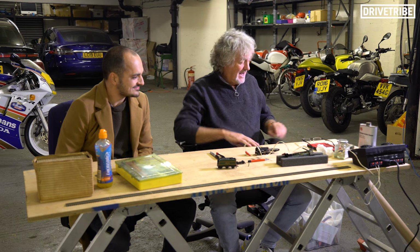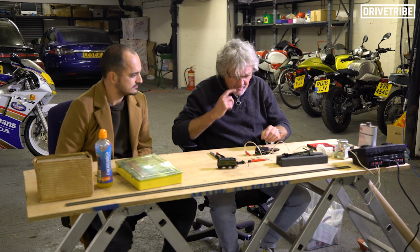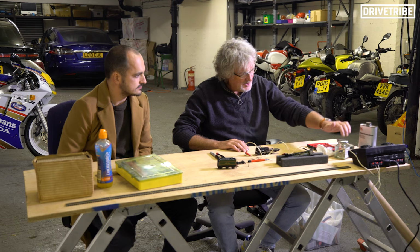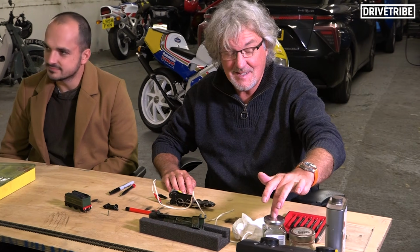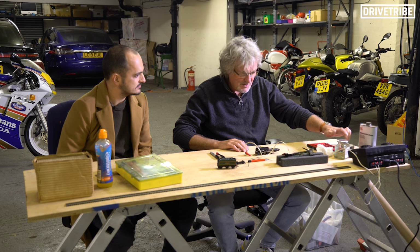But we're ready to go, and we had got to a point where we had the motor running, but not that convincingly because we hadn't cleaned it that thoroughly, because we didn't have the two essential cleaners, which are brake pad cleaner, aggressive but actually seems to work very well on model trains, doesn't attack plastic or anything, and isopropyl alcohol, which is a bit more gentle and good for cleaning things like the brushes and the commutator.